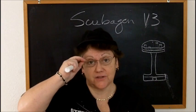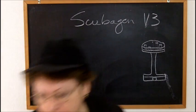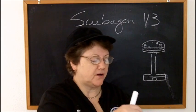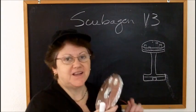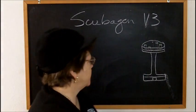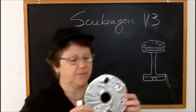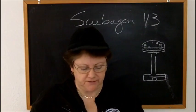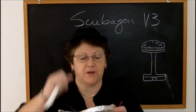So once you've got the atomizer connector press fitted into the Scubagen and you feed the red wire up, now you're going to be putting this red wire onto a nail that's going to go in one of these holes. Now this is my styrofoam mock-up of the top of the Scubagen. This is my drawing of the Scubagen that you can see, but here is my mock-up. It's got two holes that are not all the way through. That's for mounting your positive and negative connections. It's got two holes that are all the way through. This is going to be for wick,